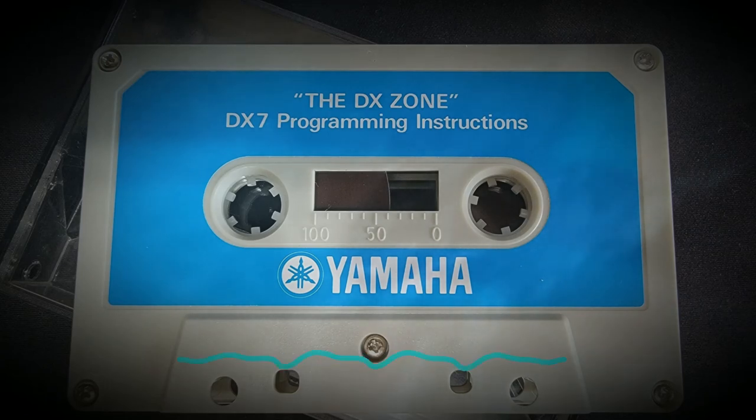After you finish, celebrate — that's your sound. It's so good you can save it. Remove the memory protect by pressing the green Memory Protect switch for internal memories and using data entry to take it off. Then press Store and while holding it down, press the memory location where your new creation will live. To edit the sound, press the violet Edit/Compare switch and make changes — all things you did to create this voice will remain the same.